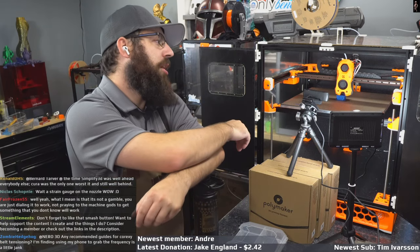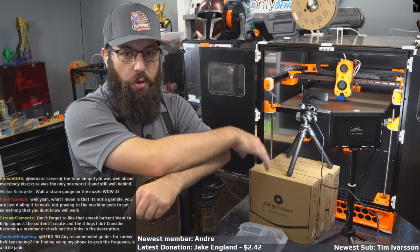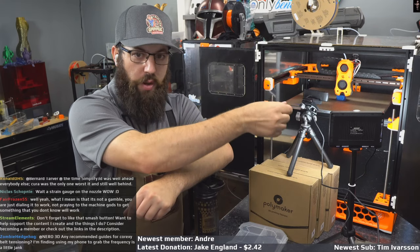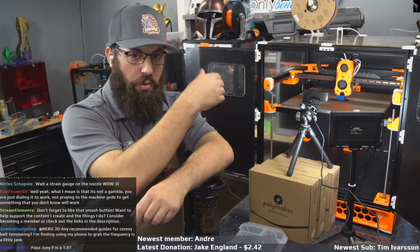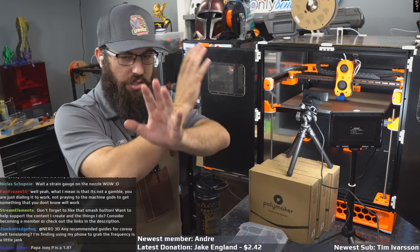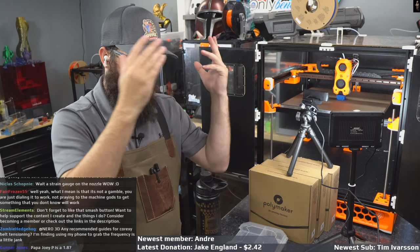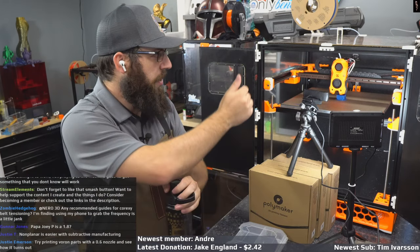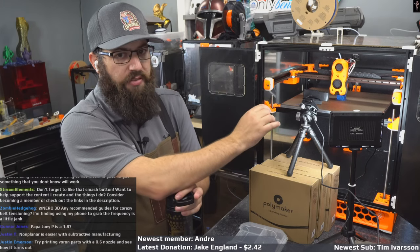The difference is when it comes to design. For example, all Voron parts are designed with 0.4 nozzles and multiples of 0.4 walls for a certain dimensioning of items. So that way you get continuous walls. Now with the new Arachne engine, being adaptive and adjusting flow, you can do smaller details. It's getting there. But the problem is you're still using a bigger hole. You're just pushing less filament out of it.